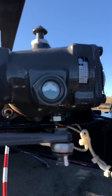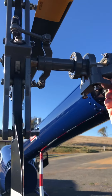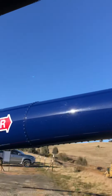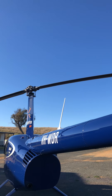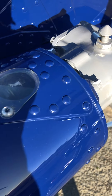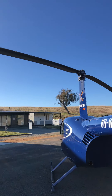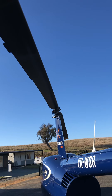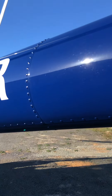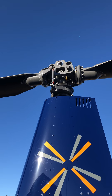Check that. There's more fluid to check up here, some more tele-temps. Double-check the movements there, and also that the rotor head can spin. Normally I'd have a ladder and check up here — there's another section. I'd spin the rotor around, check the end of the main rotor blade as it goes around, move further up, keep inspecting, get on the ladder, and check all the nuts up there. They've got those little indicators on them.